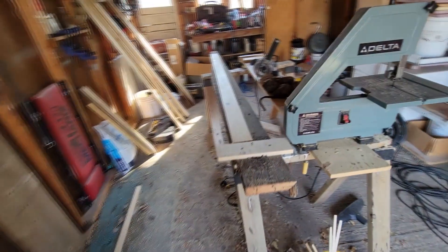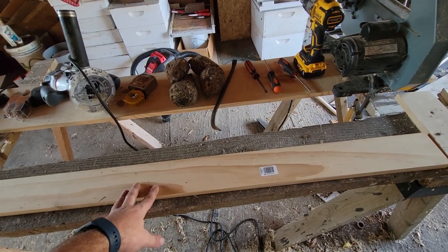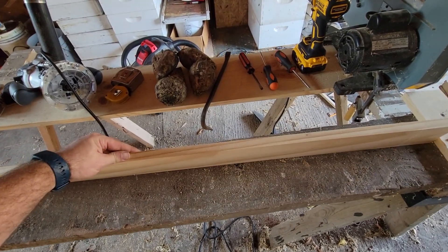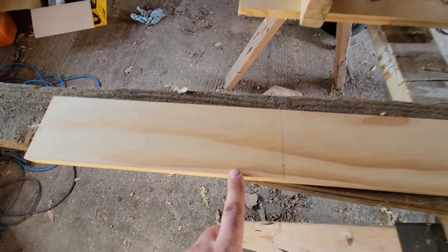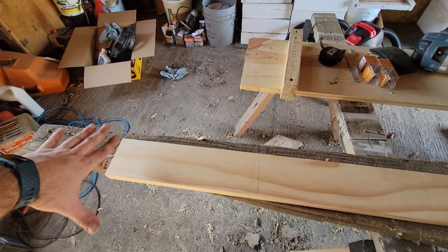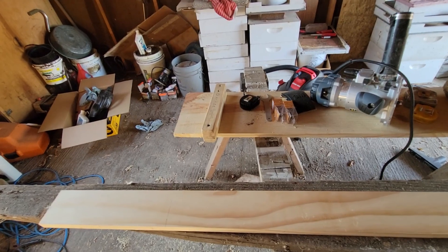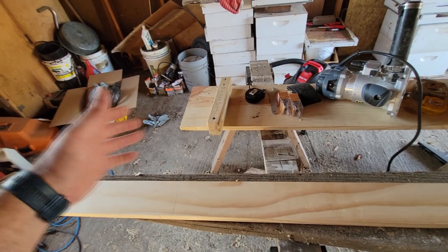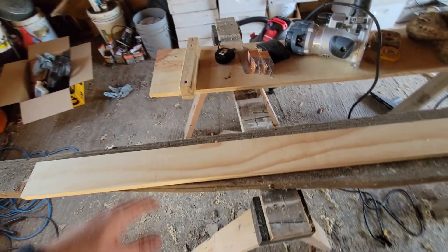To start out, I use a select pine board — a one-by-four, which ends up being three-quarters of an inch thick by three and a half inches wide. I buy six-foot-long ones and cut them to five feet. I make my fox stretchers roughly five feet because they're way easier to move around in my basement when I'm putting fur on and off. I only have seven-foot ceilings, so having a six-foot board I'd be banging into the floor joists.